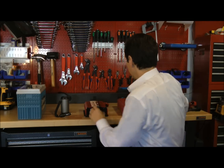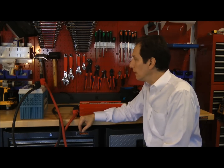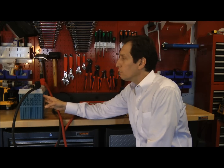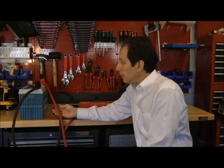What I'd like to do is wire up one of these inverters to a couple of loads and walk you through the process. I've taken a couple of minutes to wire up an inverter. The first thing you notice is I've got the large gel cell marine deep discharge battery here. The advantage of a deep discharge battery over a conventional car lead-acid battery is that it's designed with thicker plates inside, which allow you to discharge it repeatedly without causing any damage. In a pinch, however, a standard car battery will do fine. I used the heavy gauge wire we talked about earlier — if the wire is too small, it will start to heat up, which is a good indication you need to swap to heavier gauge wire.